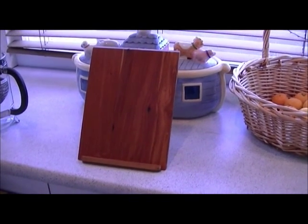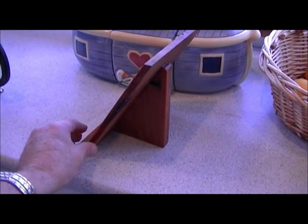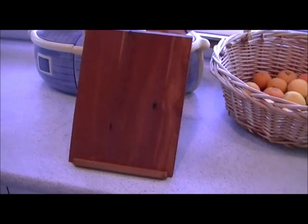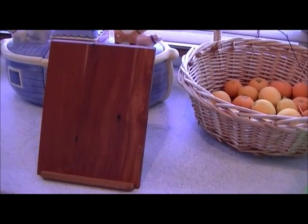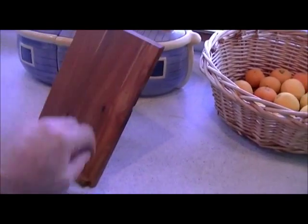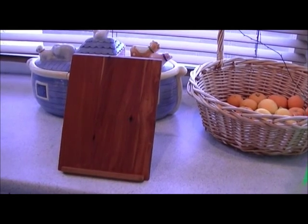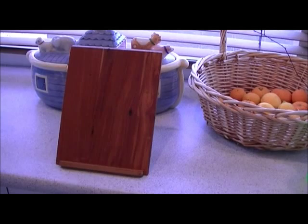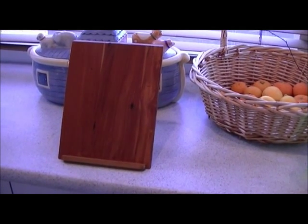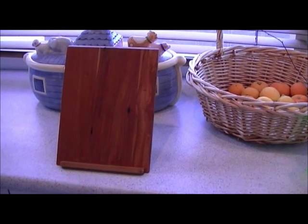What we're going to do today is just a little scrap project I wanted to do for my wife — a little iPad stand she can have in the kitchen for using recipes. The reason I'm showing it is that it's using a sliding dovetail joint to hold it together. The pieces are just scraps from a laptop stand I made her — a rolling trolley that comes in over the top of her lazy boy so she can put her legs up and it holds her laptop.